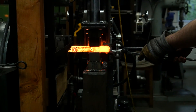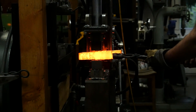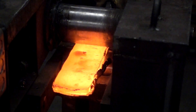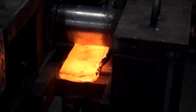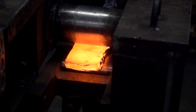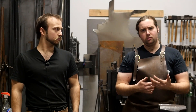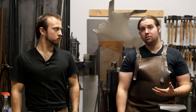Some ores would naturally give you steel with a certain working composition while others would be a bit different. Pattern welding, Damascus, or any sort of lamination is all about melding out all the different properties to make them suitable for your application. Also worth mentioning: on the rare occasion where they managed to find a really good clean steel, there often wasn't much of it. So one way to spread it out — say you needed to make two or three really good blades but needed more — you could add a lower carbon steel to the mix and basically do the same thing as adding water to a good soup.